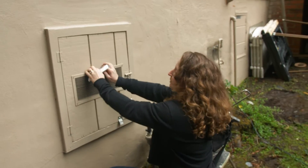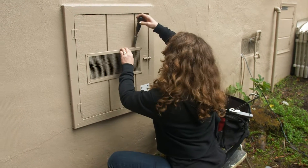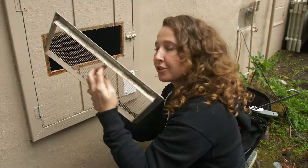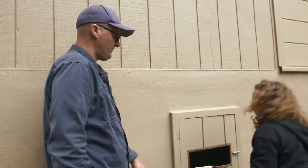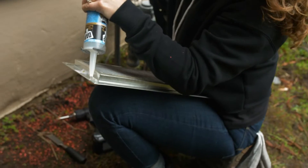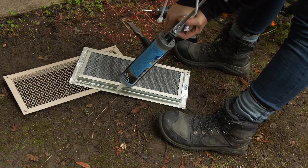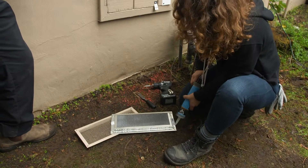It's going pretty good. Now, if you didn't want to spend all that extra money, you could use a finer mesh to make the holes smaller. Even just putting a 1/16-inch hole screen on the back of this would be a great upgrade from what we have now. That would knock out all the embers and save your insides. For the protection of your house, you want to make sure you're caulking the back of your vents. I'm using silicone here — if we weren't in such a quick mode, I'd normally use liquid nails. I'm putting a nice thick bead all the way around where the surface is going to touch. This is a standard size vent — the majority of houses have this size — and you literally pop them out, pop them in, and you have hardened. First step in hardening your home.